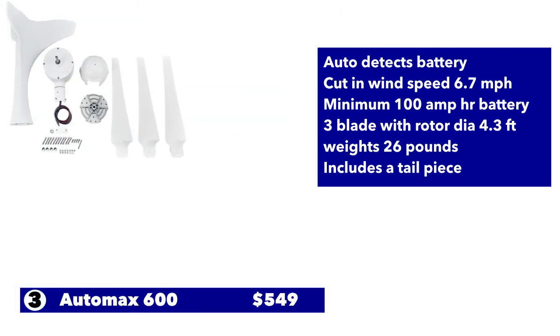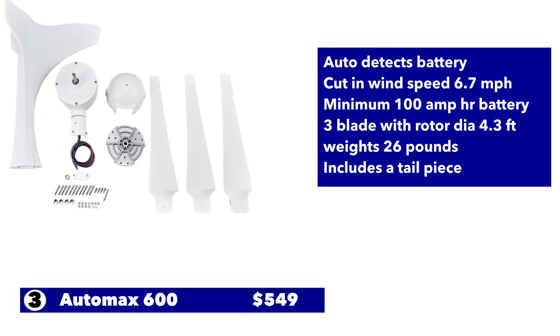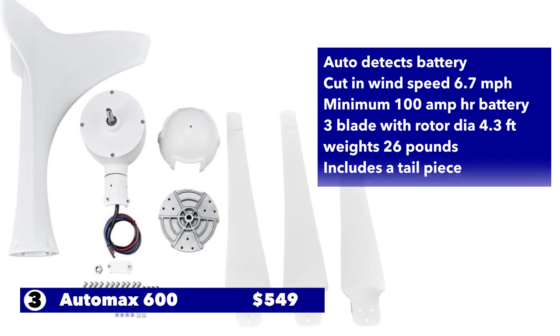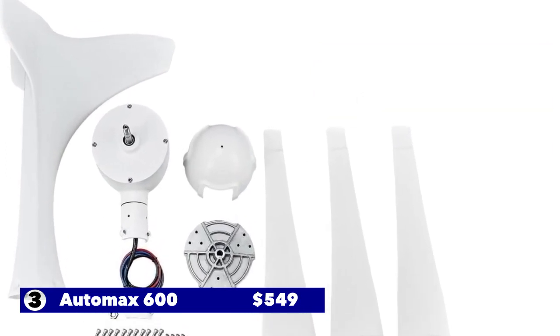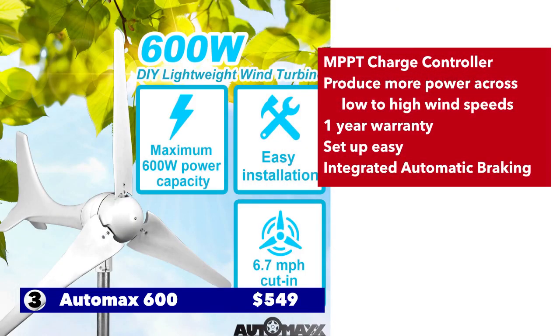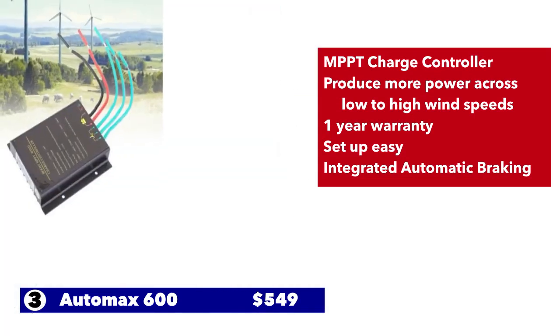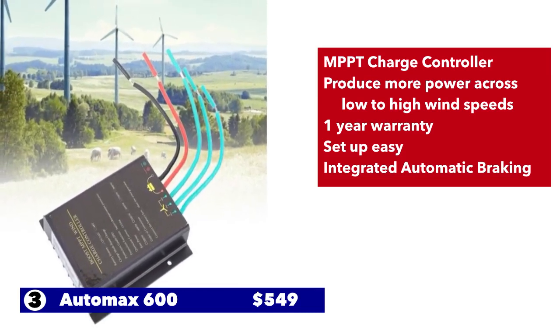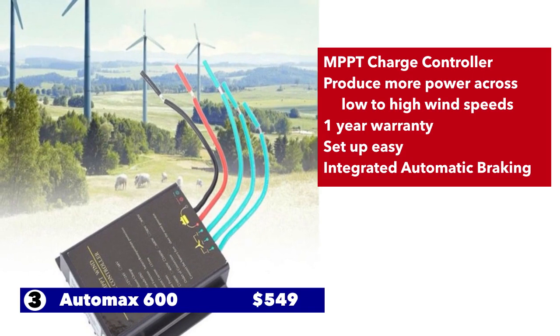It has a 3 phase motor with 3 blades and a rotor diameter of 4.3 feet. The unit weighs about 26 pounds, which is fairly light in its category. It also has a tailpiece. One of the outstanding features of the Automax 600 is its MPPT charge controller. Charge controllers we have looked at earlier were all non-MPPT. And MPPT charge controllers are better because they produce more power across different wind speeds. From low wind speeds to higher wind speeds, the MPPT controller works and optimizes your power production.